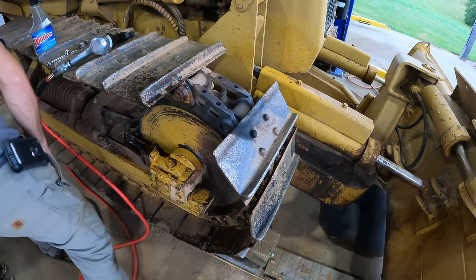Thanks for watching guys — but before I let you go, I'm going to lift this thing up and down so you can see how little play there is now compared to what we had before. That's a really big difference. When I would pick the blade up, there was a delay while the tracks would get set down — I'd have to wait a little bit. I know it was only about an inch but it was quite noticeable, and it's definitely less now. There's still some slop up front that has to be taken out, but just going from pressing down to lifting up, all the slop has to come out of the system, and that was a big part of it. Definitely can see the difference. Big job — glad it's done.